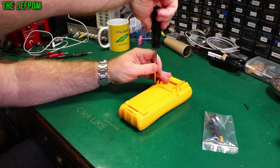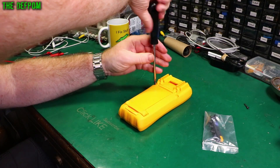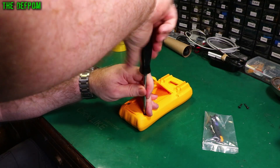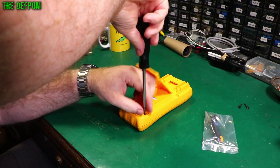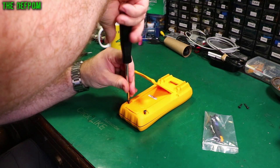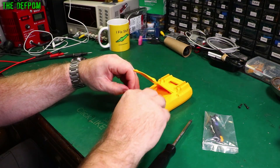If you have a 175 and you feel like having a backlight, you should be able to do something similar. You might want to make your own button up. All it needs is a carbonized rubber pad or something like that to actually make contact with the circuit board. You can even make your own one up if you really wanted to.